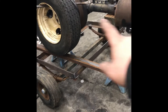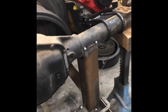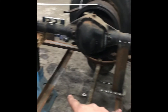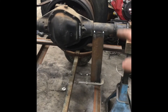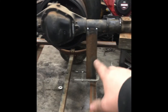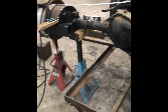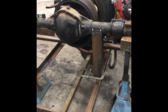Still have to build all the mounts, but I just have the very first one tacked in place right now. I moved the trailer as far back as I could while having what's going to be the main two supports, supported the best way on the frame rails. They will get triangulated in on both sides. It might be a little tricky to avoid the tire over there, but I'll figure that out. Put the tongue on, brace that all in. I wasn't going to video that. I tried to after the first time dropping the axle — I probably shouldn't put sketchy lifting of things on YouTube. So we'll not video that section. I'll just show you what I get done.